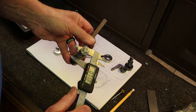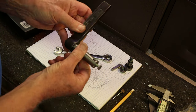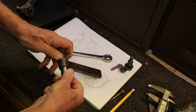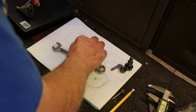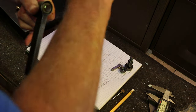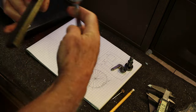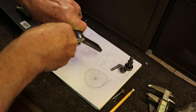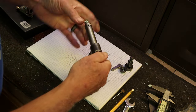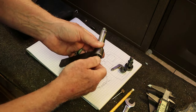Yeah, you know, it's almost 3/4. So that would be okay for a larger bore. But for our half-inch bore, we need a cutter which is substantially smaller than that. So this is the tooling I've used for cutting internal keyways,